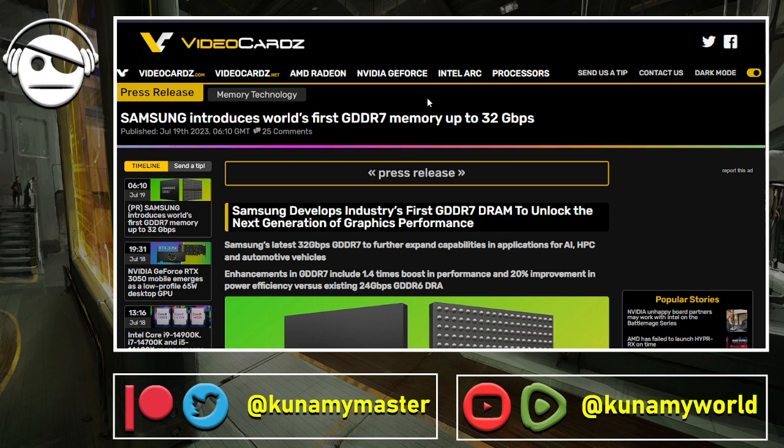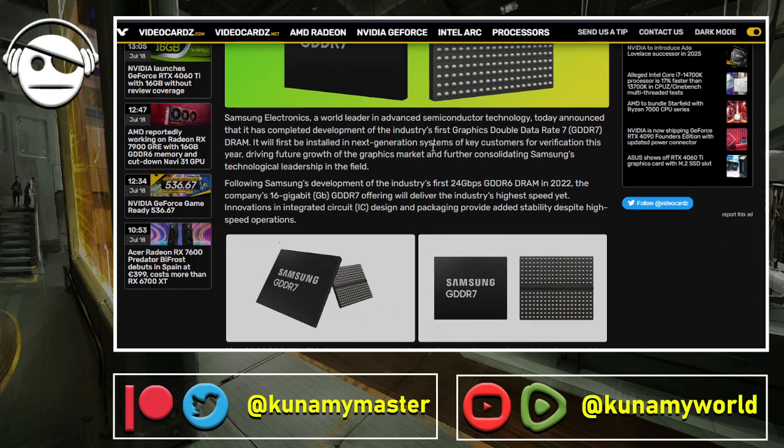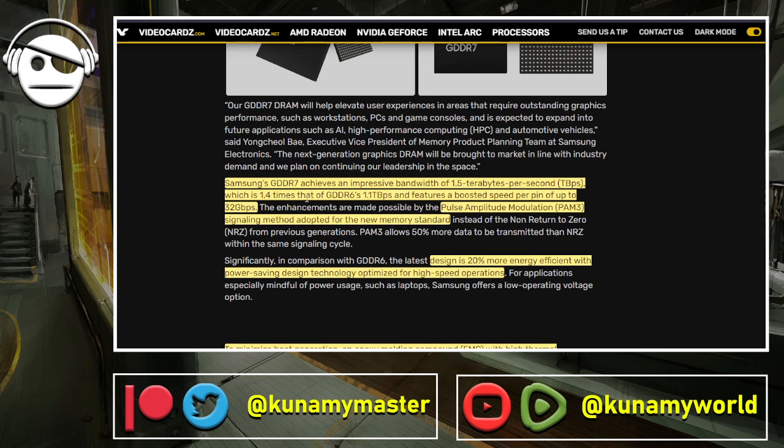The last hardware news here is Samsung. Now they did the press release, introducing GDDR7 memory, which is a good uplift in terms of performance, and even energy efficiency. With Samsung, it's 1.4 times better than GDDR6 in terms of bandwidth, and it can boost the speeds per pin up to 32 gigabits per second, which is always good, mainly because they altered how the signal between the memory and everything goes. It's PAM3 instead of NRZ, which is non-return to zero,